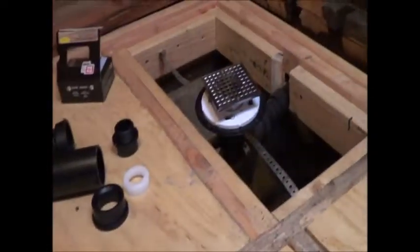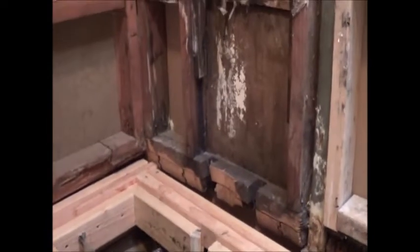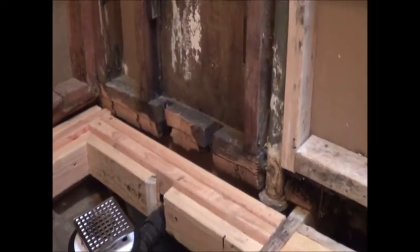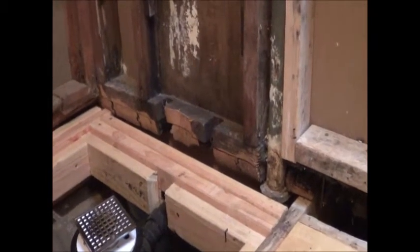That's drilled. The other thing we need to do today is get the plumbing roughed in. So you remember down here we've got the PEX connecting, but we have the old galvanized pipe connections down there. And right now they're just capped off down there with male inserts into the connectors where the pipes terminate. That's just keeping the water pressure up in the rest of the house.